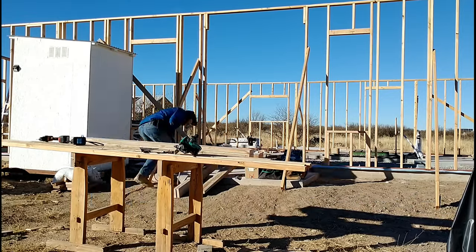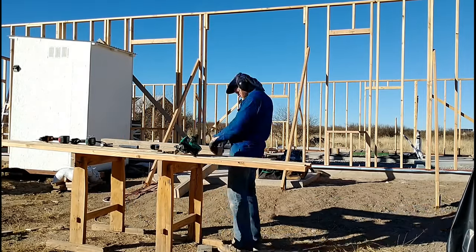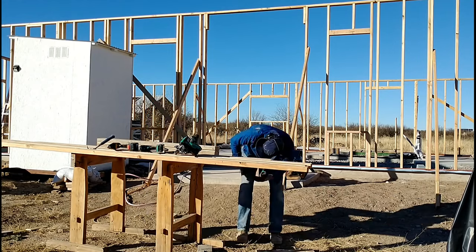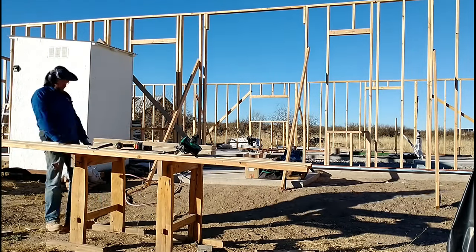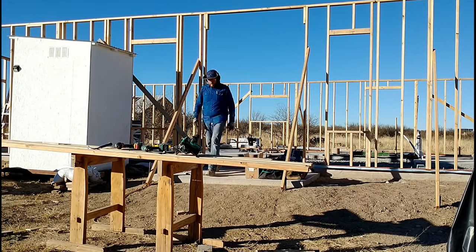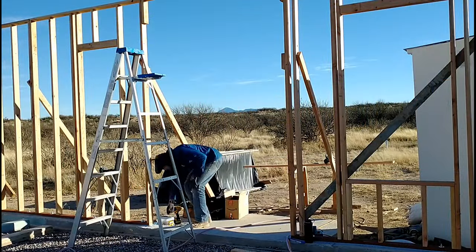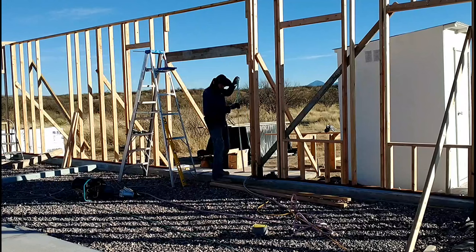For the big six-foot door span I went with two 2x8s. I hadn't bought specific lumber for these headers, so I looked around and found old foundation forms from this house that I could repurpose. I found enough straight pieces that weren't too damaged from water — they were still very sound. I liked the idea of having wood that was used in the foundation forms permanently in the structure of the house. They did need some work — I used my hand planer to straighten them out, remove a little cupping and twisting — but they didn't take too much work to get straight.